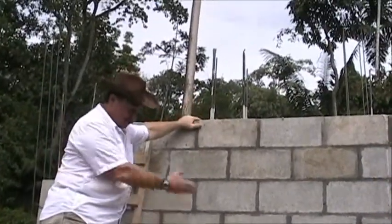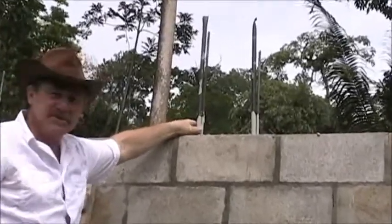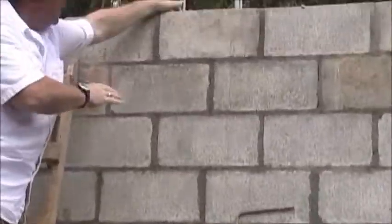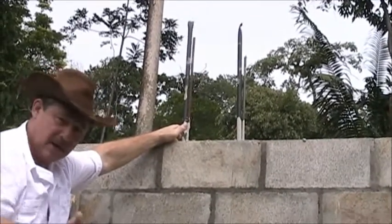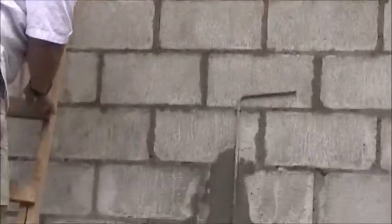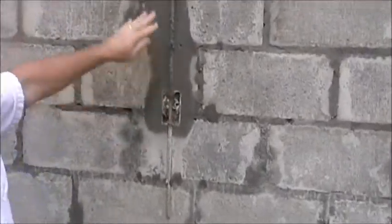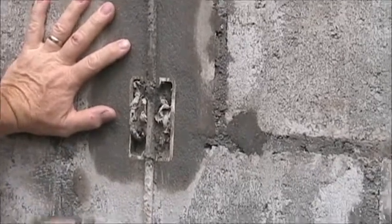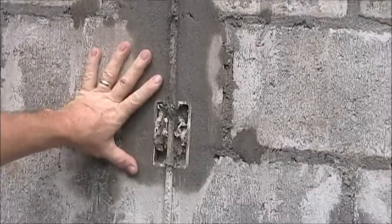As you can see, we have quite a bit of the walls built. At this level we're going to have a horizontal layer of rebar. This is how the conduit is put through the walls for the electricity — you can do it several different ways, but typically anything that's a switch comes from the top. That's how they run the conduit down through the wall. The switch box is positioned and held in place while the concrete dries. One of the nice things about building this way is it's such a fireproof system — something could be smoldering in there forever and there's just nothing to catch on fire.